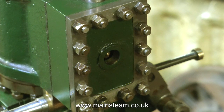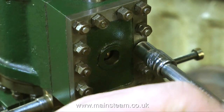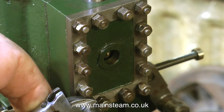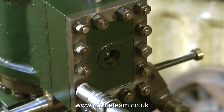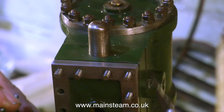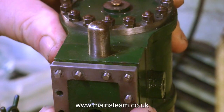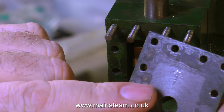The compressed air testing part of this is somewhat optimistic. The first thing to do is to remove the steam chest cover, and to do this I have to remove all these nuts and lock nuts. This took ages — I've shortened the sequence because it really was tedious. With the edge of a sharp knife — or not such a sharp knife in my case — I just lever off the steam chest cover to break the seal. But in this case there wasn't a seal; there is no gasket present, and this is looking more and more like the engine's never run.